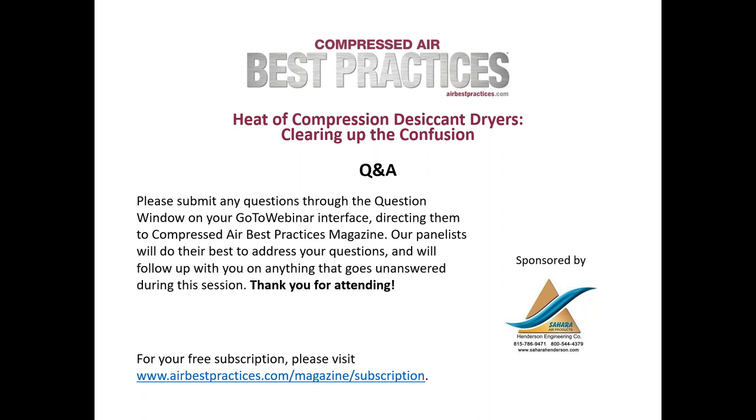Okay. This next question is for Mr. Van Ormer. It comes from a utility. The question is, are there any minimum pressure requirements for heat of compression dryers to work? Well, I think that's part of the sizing that Chuck talked about. As the pressure goes down, your moisture load goes up. I might defer this to Chuck to comment on too, but at some point the dryer may have to get so big that it becomes uneconomical. And I would like Chuck to comment on that a little more.